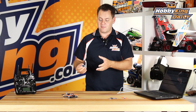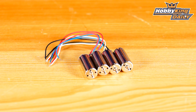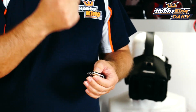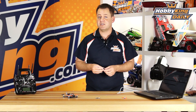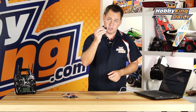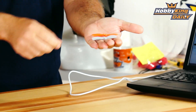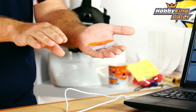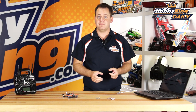Besides this board, we also brought in some 8mm motors, which are perfect for these 4.3-amp ESCs. Normally some of the smaller quads use 6mm motors for the little toy ones, 7mm is kind of the average, and then the powerhouses running a slightly larger battery — 320mAh or 500mAh single cells — use 8mm motors. We have these in stock in clockwise and counterclockwise rotation for best efficiency. To go along with these motors, we have some custom-molded high-efficiency 60mm props that are perfectly matched, so you can really design some nice long flight times — we're talking 8 to 10 minutes with this setup.